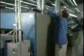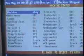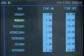The first step is to check that the exhaust vents are open and there is adequate ventilation. Now we turn on the system. This is either done at the computer or front panel, or possibly both places. In-plant safety procedures should be followed to avoid injury to personnel or damage to equipment. Depending on the size of the solder pot, the system may take several hours to come up to temperature. For this reason, many wave solder machines are on a timer, which turns the machine on at a programmed time.